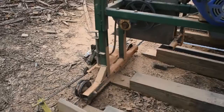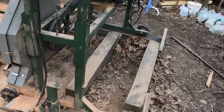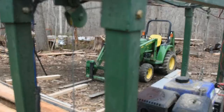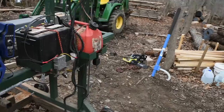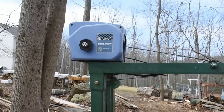I know some of you may be interested in building your own, and that's exactly what I did here. I'll tell you what I like and what I don't like. Overall, we have what we'll call the carriage or frame — this green section here. It's a two-inch, eighth-inch wall square tube. You can see four posts. I built the outer green section first.